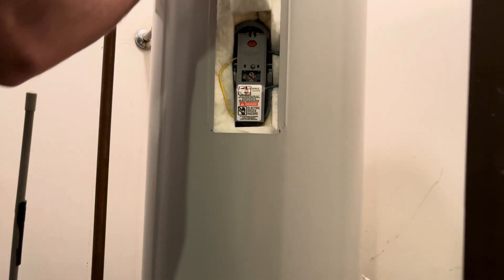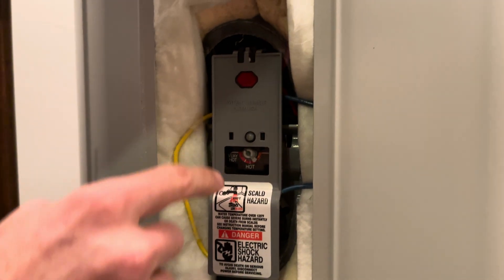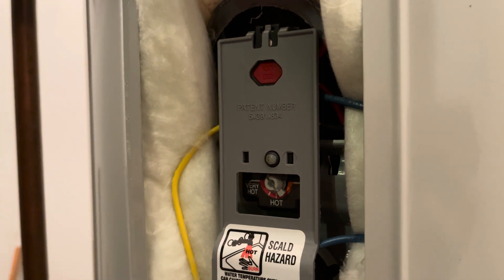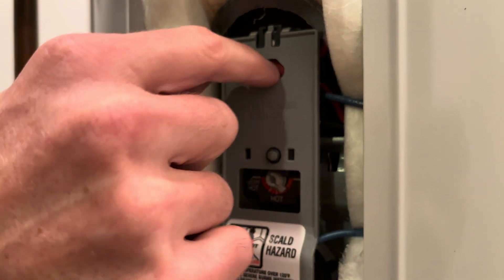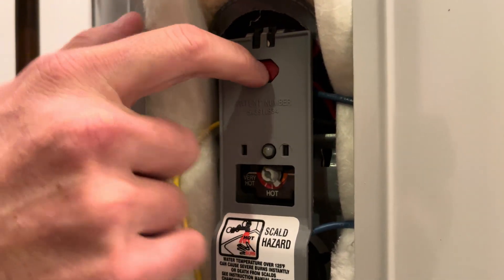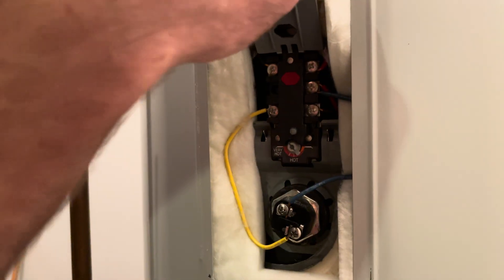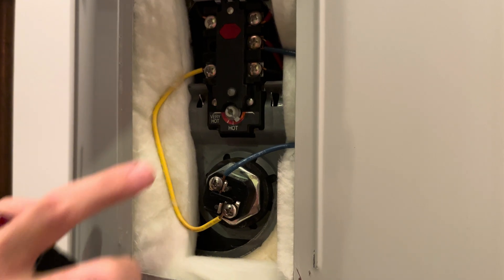When you're looking at your thermostat there are a couple of parts. The main power comes in from the top. There's a reset button and a way to adjust the temperature. If your hot water heater isn't working, one of the first things you're going to want to check is this reset button and try to push it. This one's already pushed in because this water heater was working, but it will pop out if the thermostat has tripped off for some reason. If you push it in, it'll allow your water heater to come back on.